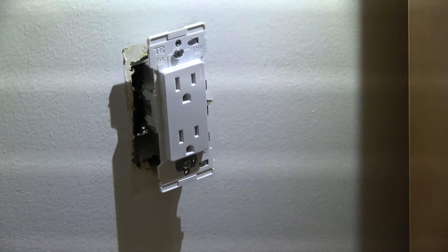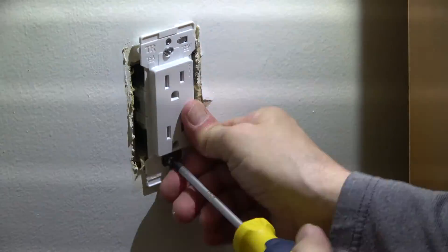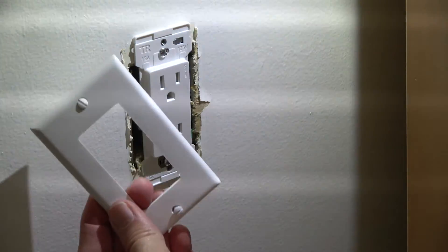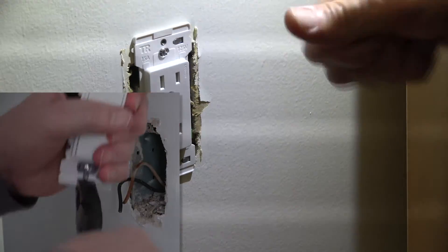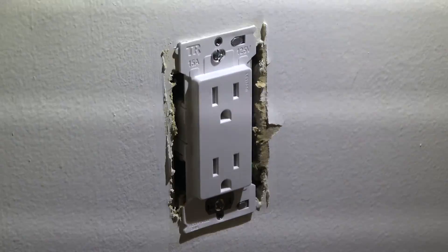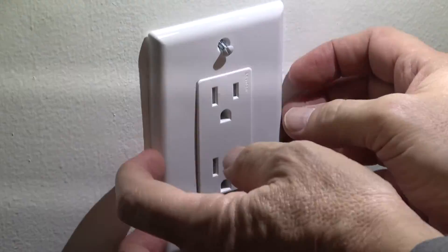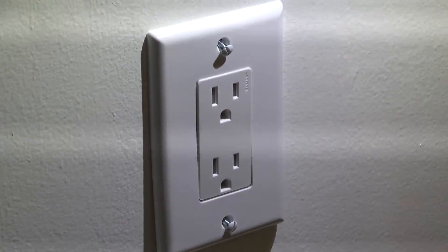We make our fastener connection at the top and at the bottom with the metal box and then just screw that in. For this, you can use a Phillips number two. I forgot to mention that this extra tab that's here top and bottom is for outlets that are taller that fit around this. That's not the case here, so I'm actually going to have to remove that top and that bottom. You just grab it with a long nose plier or lineman's plier and just twist that back and forth until it snaps off. With the ears trimmed off, then you can put a wall plate over it. This one actually happens to cover our little gap here, so no touch up needed. Just attach the two screws and we're ready to go.